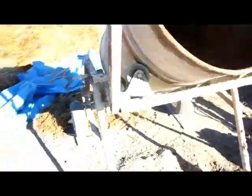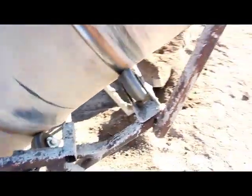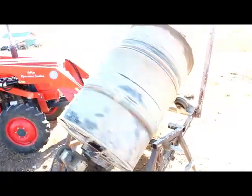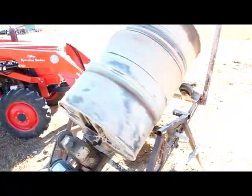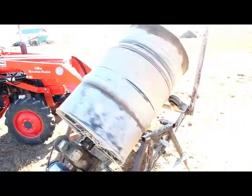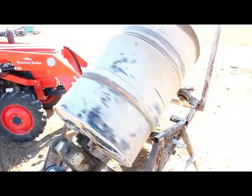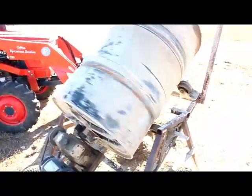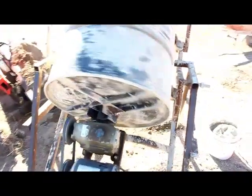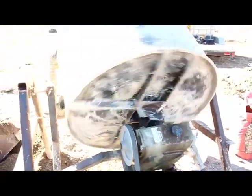It's been going strong for four years. You can see it's got a lot of wear and tear and a lot of cement mixed in it, and it still keeps going strong. The way it works is we basically just took a 45-gallon drum, cut the lid off of it, and figured out some way to lay it on so that it'll actually spin and stabilize with the weight of the cement. It'll mix about 300 to 350 pounds of cement in one batch.